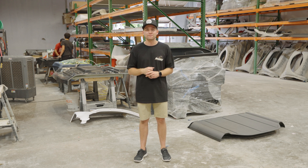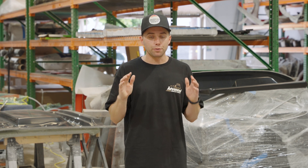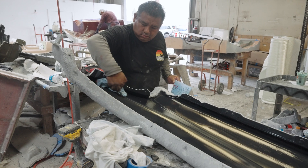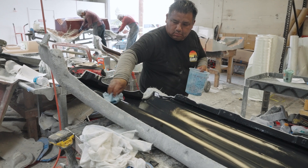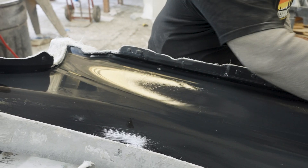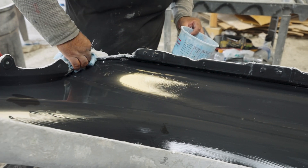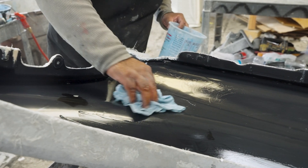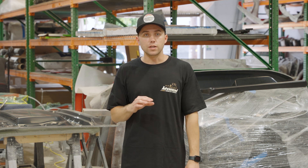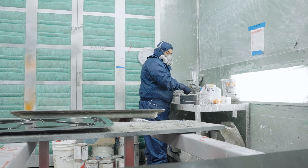So let's get started. Starting off, we have an open face mold. We're going to basically prep the mold. What prepping consists of is cleaning out the entire mold to make sure there's no dust, no dirt, no debris inside of the mold. We're also going to wax it — we use a TR-216, that's a mold release. It goes over the entire surface, we let it sit in the mold, cure up, and wipe it nice and clean. Once the mold is done being prepped, it will then move over to our gel coat facility.